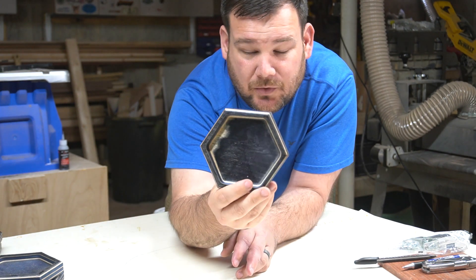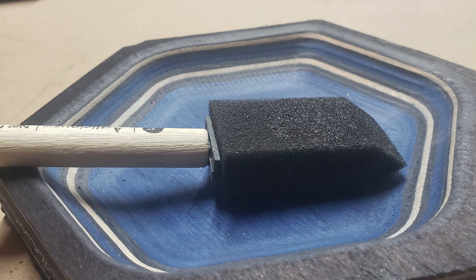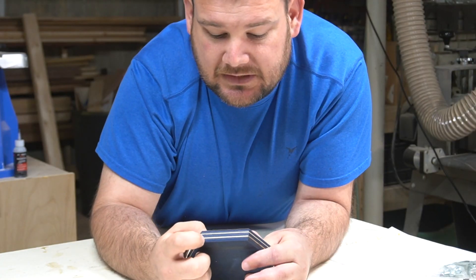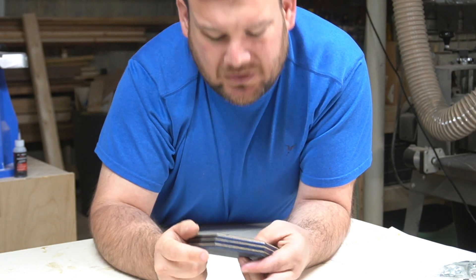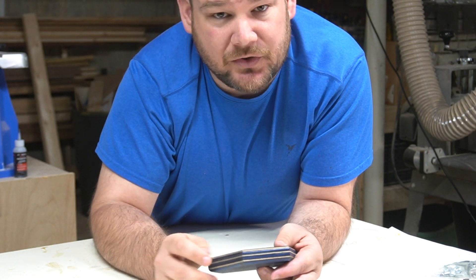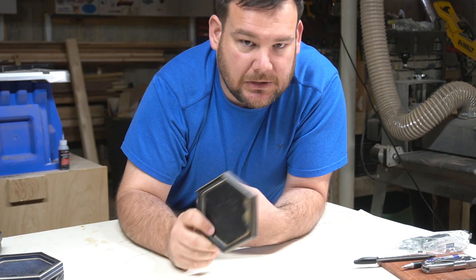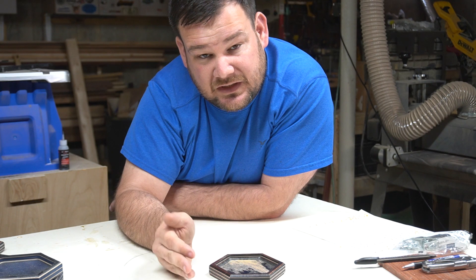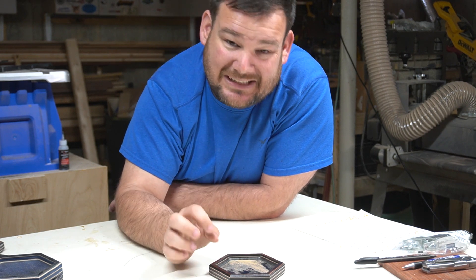This was kind of what I was going for, and I was really happy with this progress. I was really happy with the machining, so I went on to finishing. The first finish I tried was an oil-based finish, and I wasn't really happy with the colors. These are really bright colors on the edges — I wanted to maintain that brightness, but the oil-based finish darkened the wood too much. So I decided I needed to go with a water-based finish in order to maintain the wood's vibrant color.